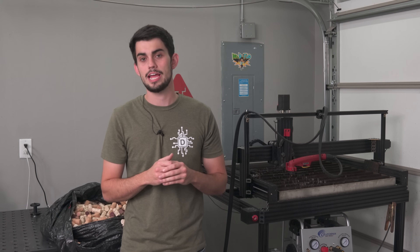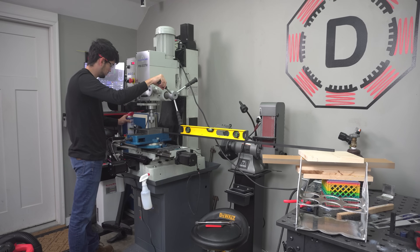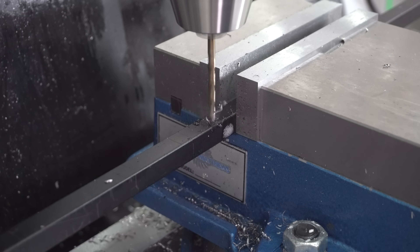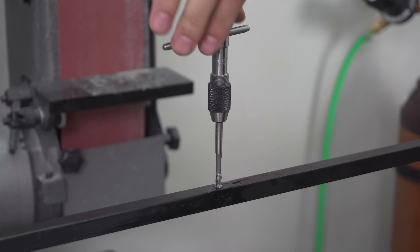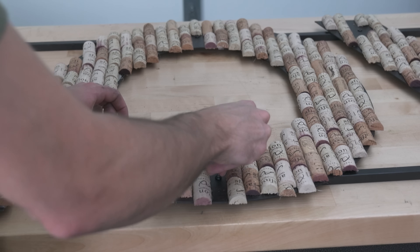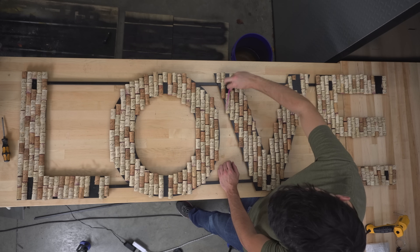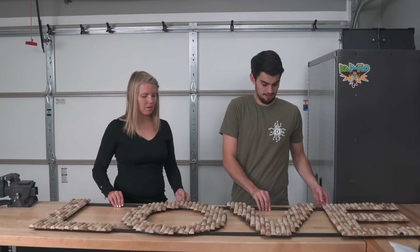To tie all the letters together, I used two 6-foot-long pieces of half-inch by half-inch flat stock. I used the mill to drill holes that corresponded to the mounting points in the letters. I then tapped those holes for M5 bolts because I wanted to be able to remove the letters for storage. I have three siblings and my sister is the first one to get married, so hopefully we can squeeze a couple more uses out of it. At the end of the video I'll have some footage of the sign hanging up at the venue.